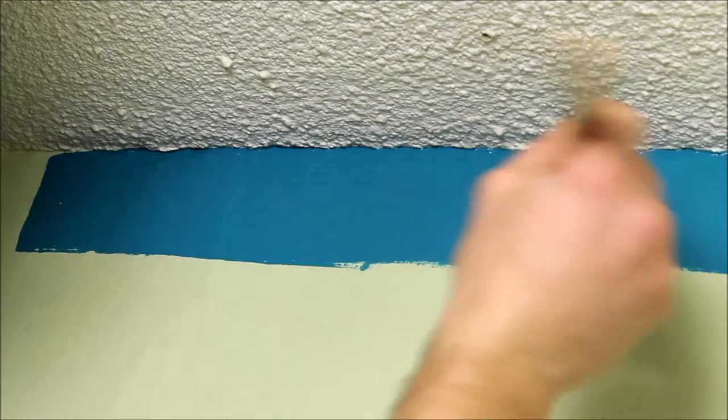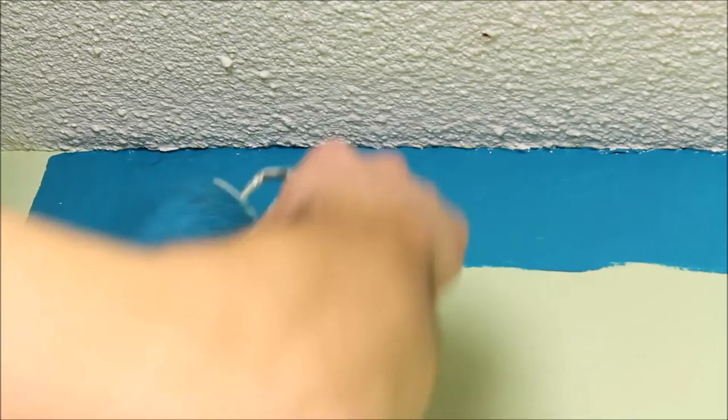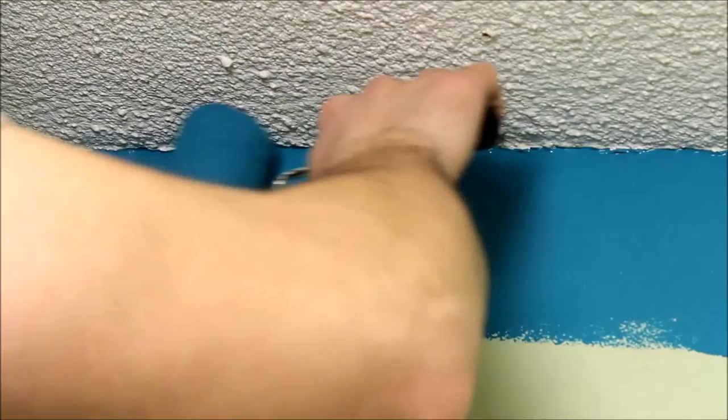If it is streaking with the paintbrush, I'm working that over after I get the paint to the top of the ceiling. To smooth out the texture you can use your little roller — just be careful not to hit the roller on the ceiling, otherwise you're going to be painting the ceiling the same color as your walls. This really just matches the texture to the big roller once you do the entire wall. It's a faster process and you don't have to get as high with your big roller.